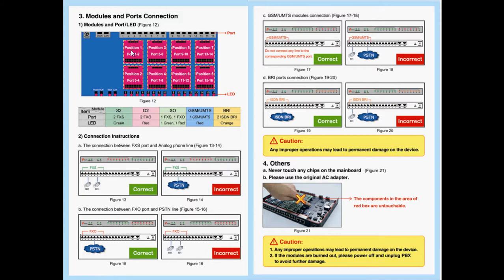For example, if it was an analogue trunk card, the LEDs on the front of the system would indicate red on ports 1 and 2. If we had an analogue extension card in position 2, ports 3 and 4 would have green LEDs, and if we had a combination card you would have a green LED and a red LED. From the front of the system, an engineer can see via the LEDs what modules are installed. Also, if an analogue trunk is ringing, it flashes at a different rate, giving diagnostic indication of what's happening on the ports.